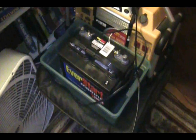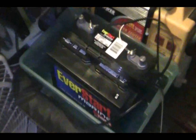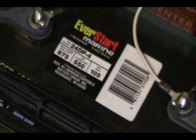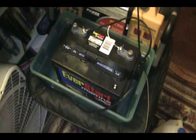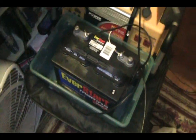System number three — if you guys follow my videos, you can see a big upgrade here. I now have a second deep cycle marine battery that's flooded lead acid. The previous battery was a 28 amp hour AGM deep cycle battery. The difference is the capacity — this one's rated for 105 amp hours, so I get a lot more capacity out of it. You're only getting maybe about 52.5 amp hours out of it since these batteries can only be discharged down to 50%.